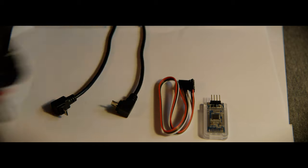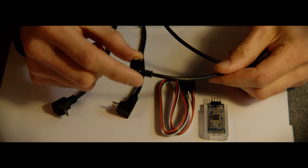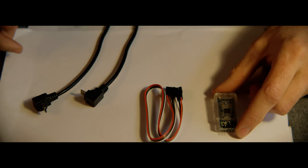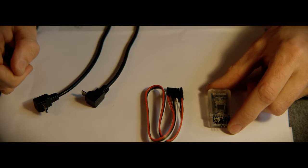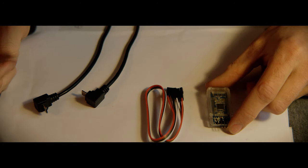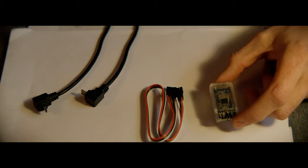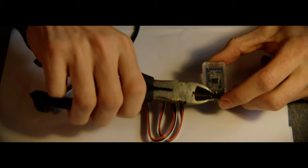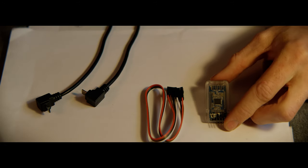If you want right-angle adapters — this one turned out a little ugly but they came in a packet, which was nice — you can find them pretty cheap and they come in two-packs as well. After changing the baud rate of the Bluetooth module to 115,200, we can just snip off the RX pin — we're not going to need it, so there's no point keeping it around.